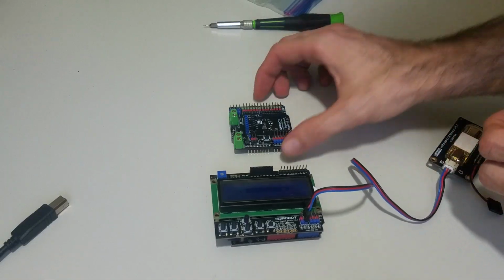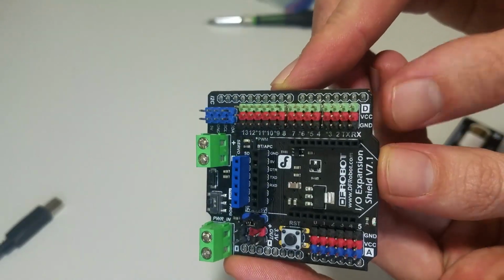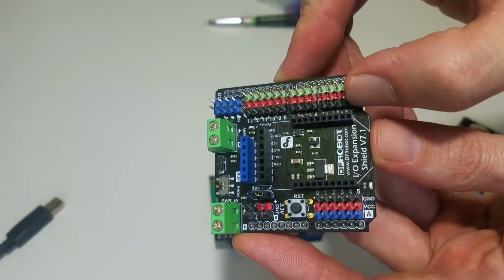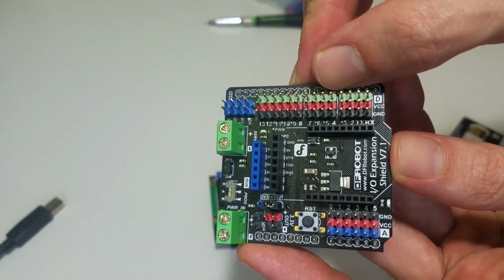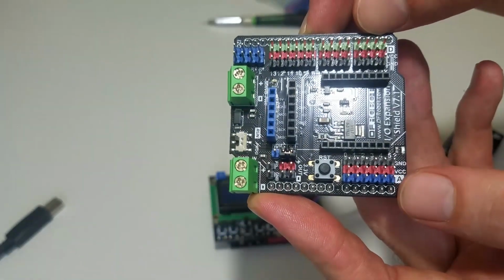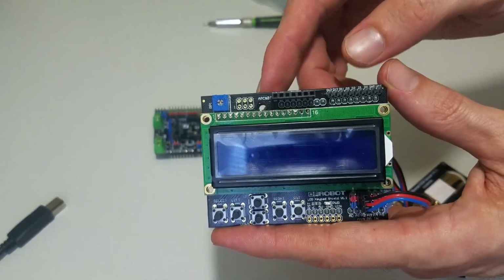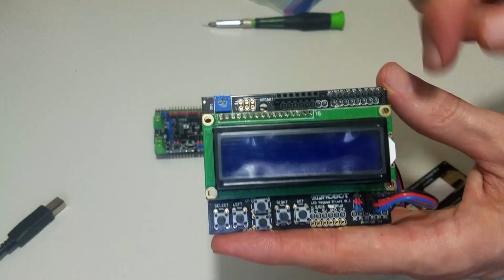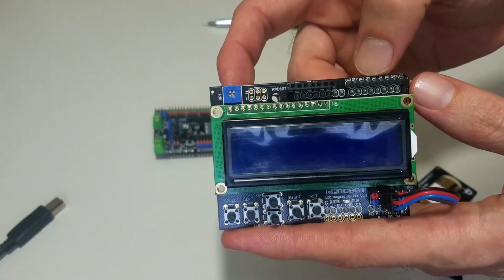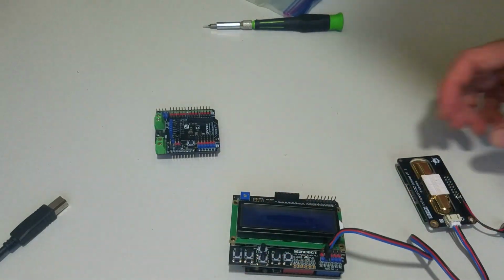And they need to hook up to the digital interface on your shield. And so that is right here. It's the green line. This is the positive, negative, and the green is the data line for the D is digital, and the blue one down here is the analog. So on the LCD shield, the digital is up here, the analog's down here, of course, and the digital you can see D0, 1, 2, 3, 11, 12, and 13. So what we want to do is hook up the digital.